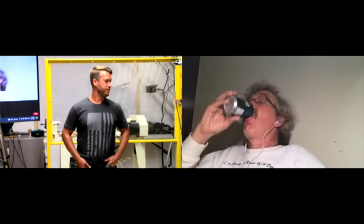Bradford pear is one of the best woods to turn — glorious to turn, really excellent. He should have taken more pieces. The thing about Bradford pear is that once it's dry it's probably the hardest American wood, the grain is very fine, and you can get the sharpest, most beautiful detail in it. He took a couple of decent-sized chunks and removed the pith to hopefully keep them from cracking.